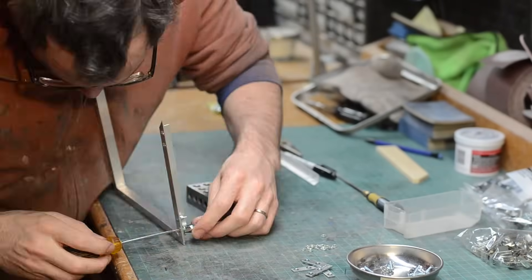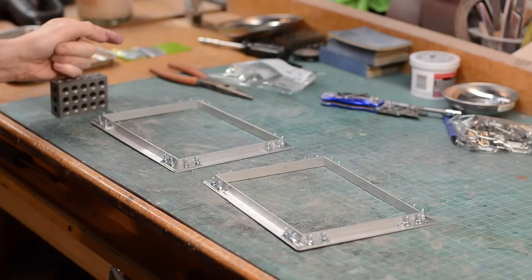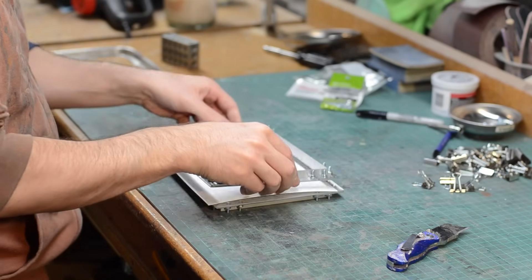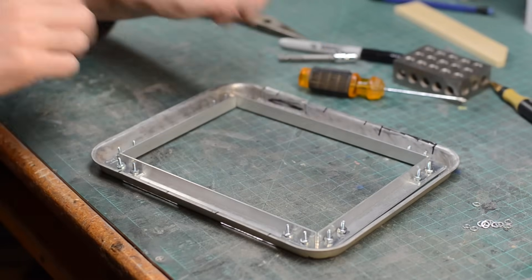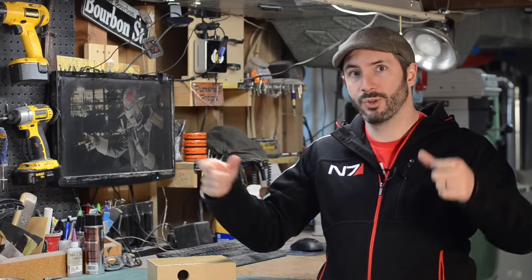This left a frame that is nice and sturdy. This needs to be clamped together with another piece for your plastic, so I made two of them. You can use your frame to cut out the exact size of your plastic, and then using some binder clips your plastic gets clamped between your two frame pieces holding it perfectly in place. I also cut a hole out of the tray that goes in the toaster oven so that my frame could fit right in there and slide into the toaster oven, suspended over the heating elements. You could also use spring clamps or 1-2-3 blocks to support it.